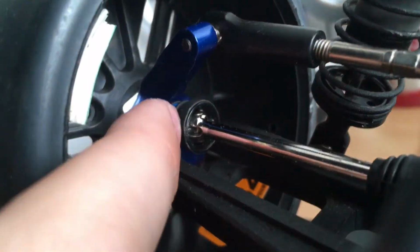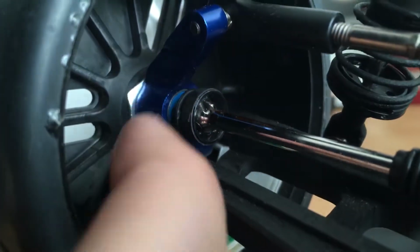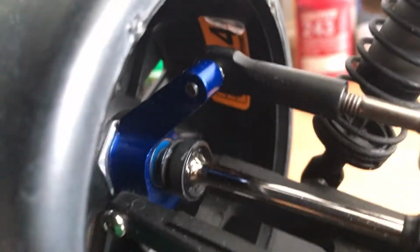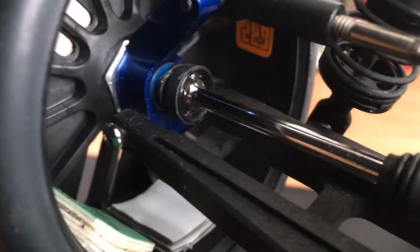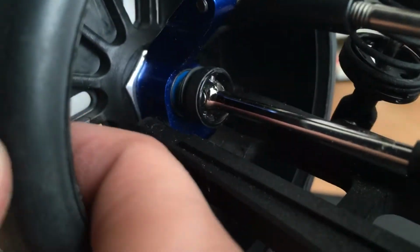So I took it off and I was like, how can I fix that? What I did is I soldered it in place on this side and this side. And then I also put a little shrink tube around it to make it tight and look as if it came like this from the factory. And then I lubed it up and it's good to go. Keep in mind, guys, I don't know if there are subscribers of mine that use the rubber sock that comes straight from the factory, but the pin comes out just a little bit, and that could cause damage. You could strip out the whole knuckle because the little pin comes out just a tiny little bit. You do not want that to happen. You want to have full contact all the time.